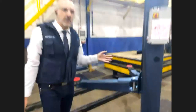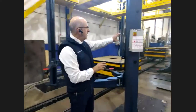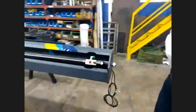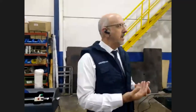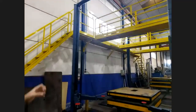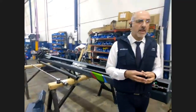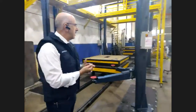The synchronization system of the lift is based on a main and a slave cylinder. The main column has inside the hydraulic cylinder, which has oil in the working chamber. After the bleeding procedure, all the oil in the working chamber of the main cylinder passes through the bypass connections to the auxiliary chamber. With this type of valve and this system, we can proceed to do the bleeding without getting our hands in oil — no oil on our hands. Now I will show how to do the bleeding.